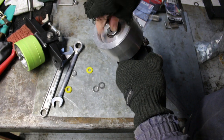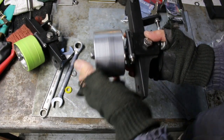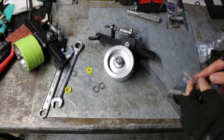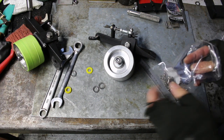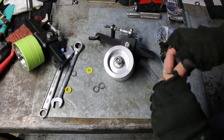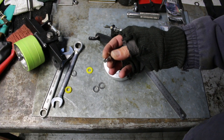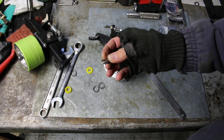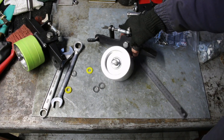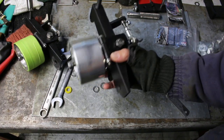What I have had happen — due to the fact of the wheel going that way — is any wheels on that side of the machine, these nuts tend to come loose nine times out of ten. So what I'll also do is use these half nuts, or cinch nuts, or whatever they call them. I just lock it with another nut. You've probably seen on my prototype machine I've just got actual big nuts — they work really good but it just looks a bit silly. So I'll stick them on underneath or on top to hold that on. And that's the basics of it.